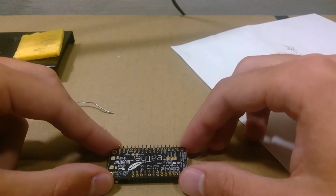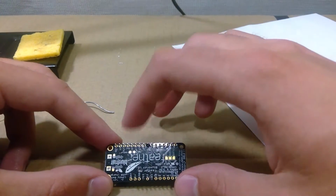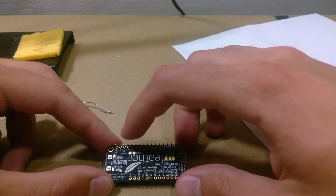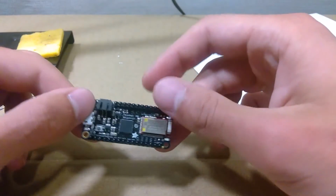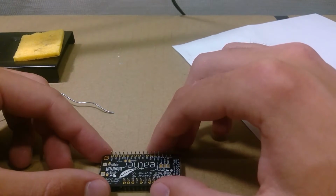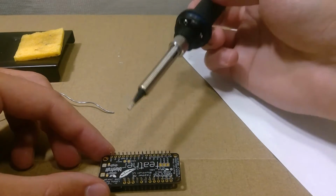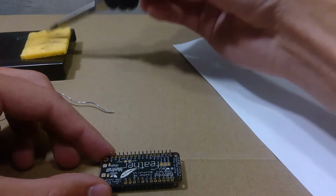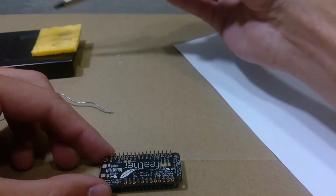Ground pin is gonna be harder because for the solder to flow, the metal pad that's gold colored needs to be hot enough. And the ground has a lot more surface area. It's connected to a big metal plate in the center of the board or someplace along the board. So it's going to take a lot more heat to get it to the temperature for solder to flow, as you guys will see shortly. So this one is harder. It's the hardest pin to solder in the board. And if there's two grounds, one of the two hardest.